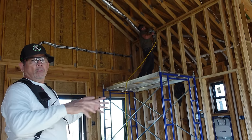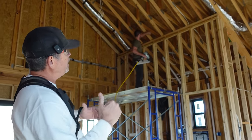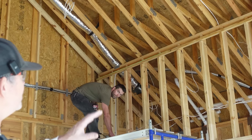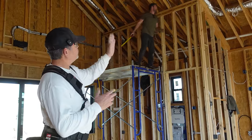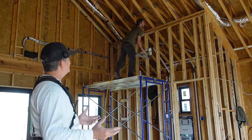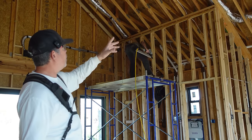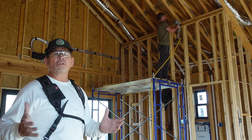Now we had it done and we all came down and we noticed that the gap between the top of our ledge and the bottom of the trusses wasn't parallel. This side was like an eighth off. We can live with that. Your eye's never gonna pick it up, but here it was more than that, like an inch. So we're not sure why that gap is 4 on one end and 5 on the other. We built this thing with lasers. It should be good, but that's one thing we're learning on this build. So what we did, we just raised the left-hand side so we have a consistent 4-inch gap all the way across. Not gonna rely on our trusty laser in this situation, but at least it told us we were off.